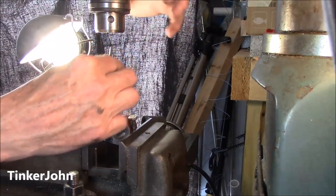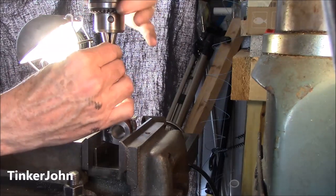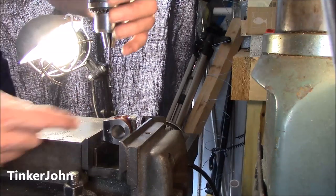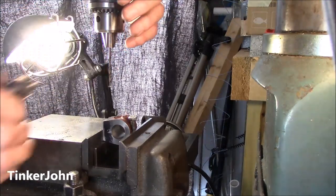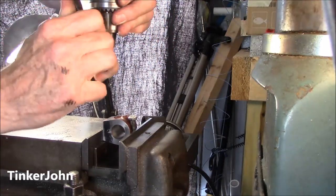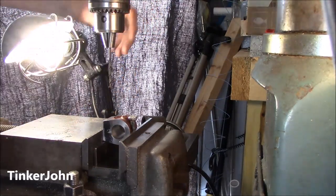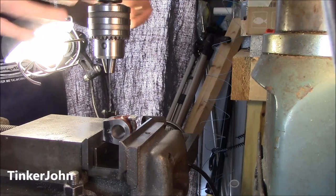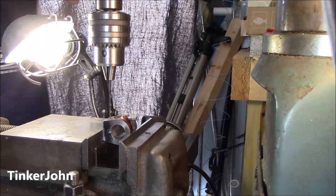Again, just going to go through with the number 33 drill bit. When I put my exhaust and intake on here, I've got a good almost 3/8ths, perhaps 7/16ths of an inch down to that port. What I will do is go ahead and drill out about a quarter of an inch or so, use a bottoming tap, and I'll either tap or JB weld or Loctite the exhaust and the input piping into the steam engine. Let me just go put that down through there and get started.